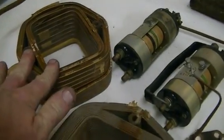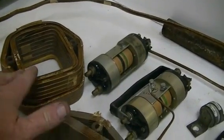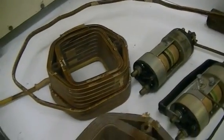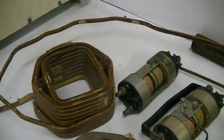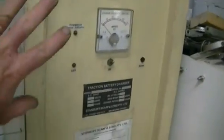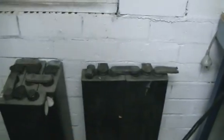We're going to have one hell of a big primary coil. My multimeter won't give me a reading — it just says zero, so I'm guessing the resistance across that coil is less than 0.01 ohms. This is our battery charger, and the large battery bank we're going to be using.